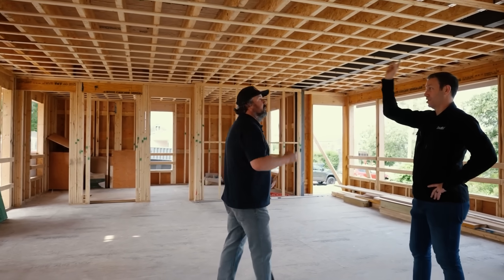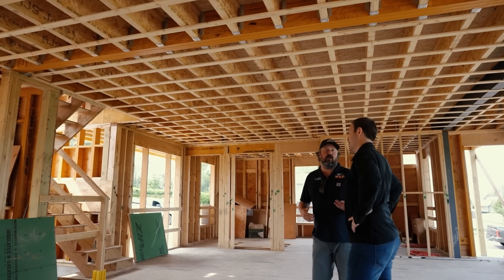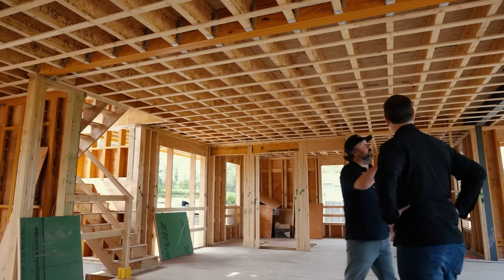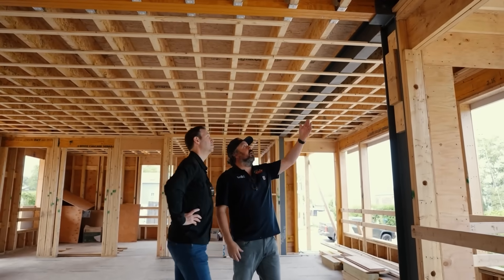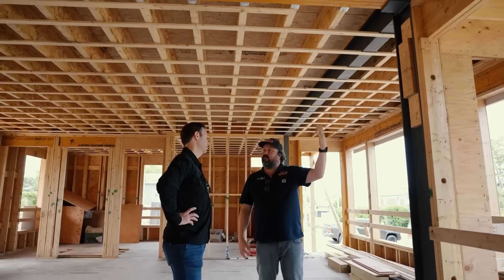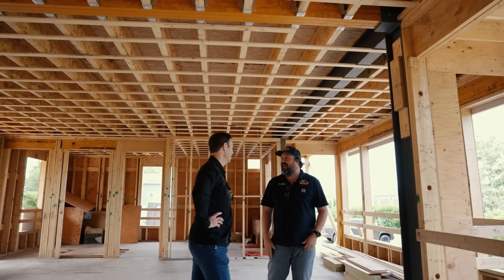This is a perfect example right over us — every guy in the south has seen this and it's caused problems in their drywall. You have a flush beam here with hangers on it — it's so hard to get that looking nice. A really good framer getting paid well might plane off an eighth of an inch off those I-joists and flush up his hangers, but not every framer will do that. The strapping allows us to bypass that inconsistency of the hanger and beam. When you have a saddle for that beam welded on with a half inch of steel plus shims, without strapping you'd have to cut around it and patch and tape the sheetrock.